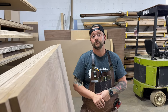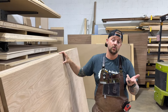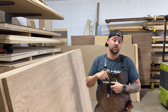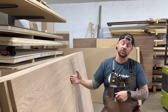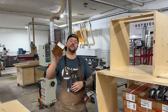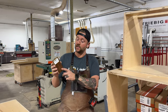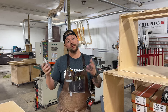So what are you finishing the cabinets with? These are getting stained with General Finishes Enduro Spray No Wipe Stain, which is a new product — they're doing formulations at General Finishes, so it's not widely available yet; I believe it's coming out this quarter. It's a color called Burnt Umber, and then it'll be top coated with the Pro Series Clear Polyurethane. Here's a sample of what the finish should look like — this is the chip that we're matching. These are both water-based finishes: the Spray No Wipe Stain is essentially a dye, and then the water-based polyurethane topcoat. We'll get some footage of that when we start finishing these cabinets.